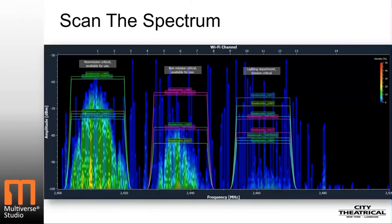Before you set up your wireless DMX broadcasts, it's easy to use RadioScan to do a quick scan of the 2.4 GHz and 900 MHz portions of the spectrum to see what activity is around you. Then to direct your broadcast to the best area. The alternative to that is to set up your wireless DMX system without knowing what other radio activity is around you and to hope that it works. But hope is not a good strategy when your career depends on it.